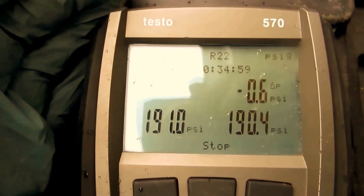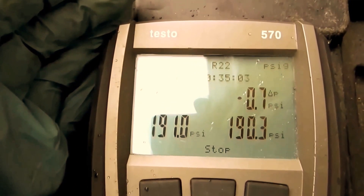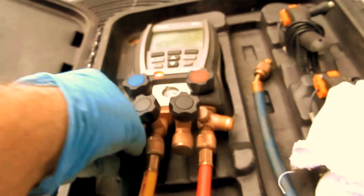Alright guys, I've had it on there for about half an hour. Let's see — there's something of rain out here. Set it on for 34 minutes and it's dropped less than half a pound. So I'm calling that good — that might be the gaskets on my stuff being off a little bit. I'll pull a vacuum and see how it pulls down.